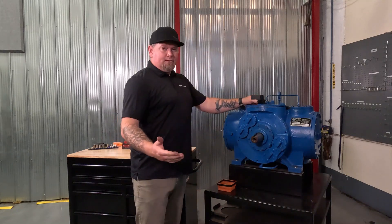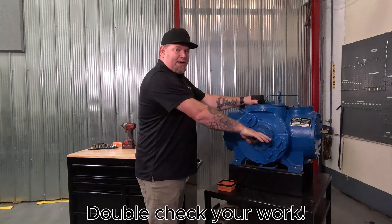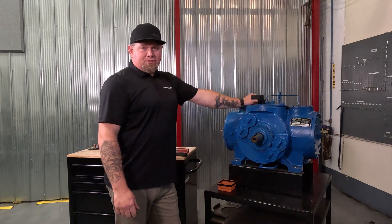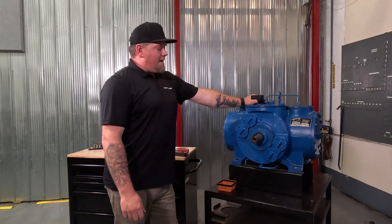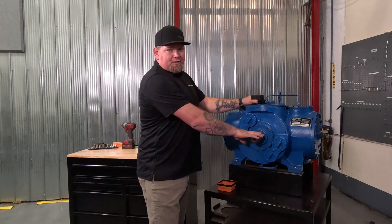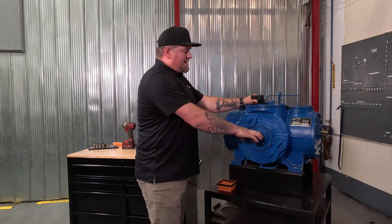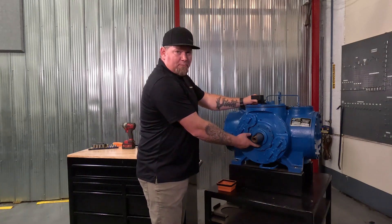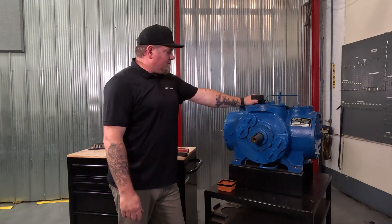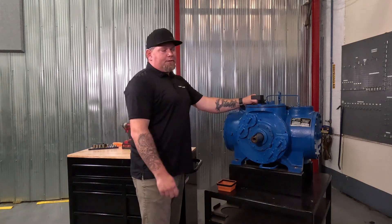With that finished, the seal change is done. Before you put the coupling back on, definitely do a leak check — you can apply air or dry nitrogen, with dry nitrogen being the best alternative since it's a safe, dry gas with no moisture. Then remove the dry nitrogen, evacuate the compressor, and return it to service with normal refrigerant, provided there are no further leaks at the seal. Put your drip tube back in, reassemble the coupling, and make sure the guard is on before removing any locks and lockout-tagout procedures. Then you can return the compressor back to service for a good long running life.